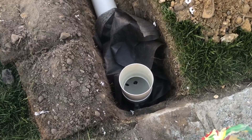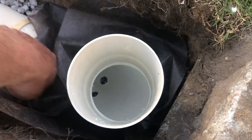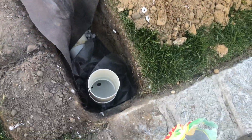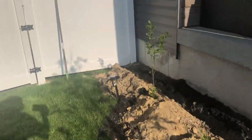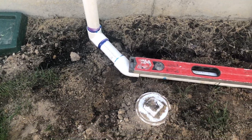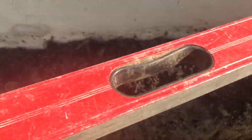Front left is done. We have the end where the downspout is all burrito-wrapped with rock around it, making it a little mini dry well, so that when the water no longer has any pressure from rain or the sump pump it can drain back into the ground. It's tied in starting from the back where the sump pump is — I had to make it come over on a 45 going that way because it was so much further down. As you can see, we're completely downhill so the water will gradually drain toward the street.